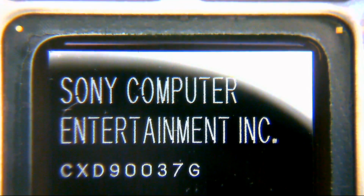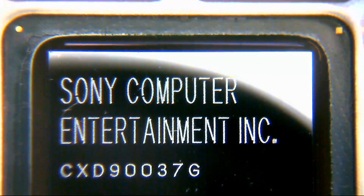So we've just cleaned that. What we're going to do is clean the other side of the heatsink as well, where the board goes into the machine. We'll clear the fan out because it looks like there's a fair bit of dust in there as well. None of that will be helping. We'll replace that thermal paste with some Arctic MX4 thermal paste. And then, once we've got the machine partially reassembled, we'll plug it in, test it, and then see if we can work out what that disk drive issue is. Hopefully it's something trivial. It might just be something as simple as a dirty laser. And again, it might be something as complicated as needing to completely replace it. So let's get that done, and we'll see you in a sec.